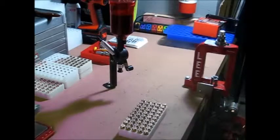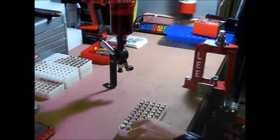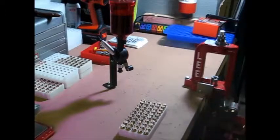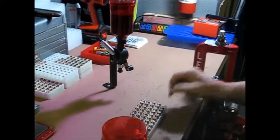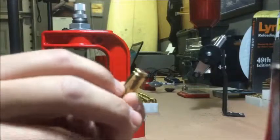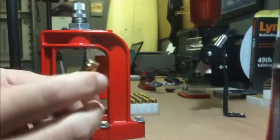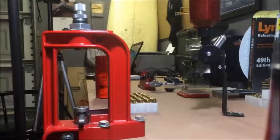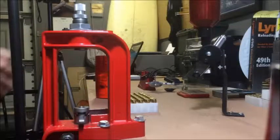Okay, so we're now going to one of our last steps, and with this step, a lot of people talk about Glocked up brass and things of that nature. So what we're going to do is bulge bust it, make sure that it can properly function in our Glock weapons. When the Glock fires a round, it'll have a belling that occurs down in here that'll bulge it out, and because it's an unsupported chamber, when you go to reload, it will not seat properly inside of the barrel.